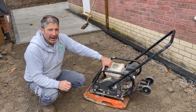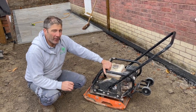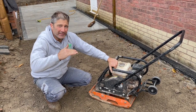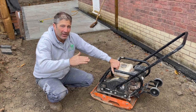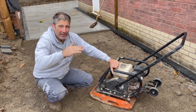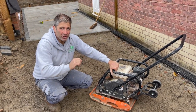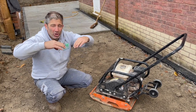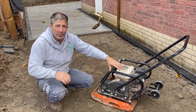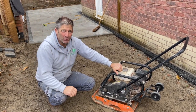We're at that crucial stage now where we've got our sub base in place. We've gone over it several times, but we're just getting the final level. It's so important that each level of your driveway installation, from your substrate being the dig, to your sub base, to your laying course, needs to be exactly straight and level. No undulations, because what will happen in that situation, your type one, for example, will start to unbind and start moving around. Spend a little bit of time on preparation. It's key to a good installation.